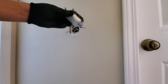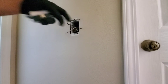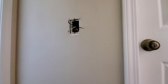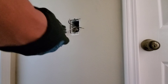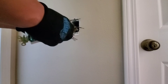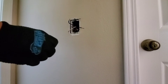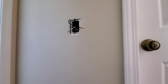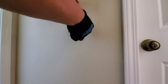With these wires I'm not going to loop them around the screw because these switches have plate terminals where the screw clamps inside. I can trim back a little bit here because I think I cut too much. Looking at where I was — my red wire was on the single terminal, my black wire was on the hot one. So this would be my primary, my secondary, and this would be my common and traveler. On this new switch, we know this was my common, so let's put this black wire on that.